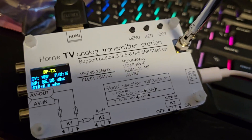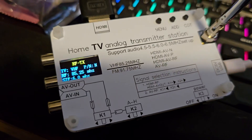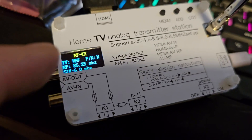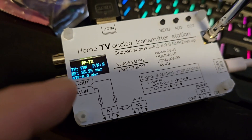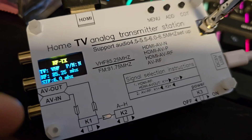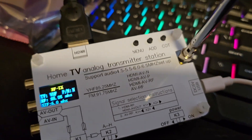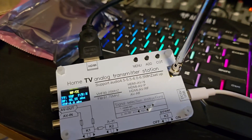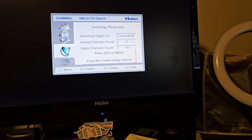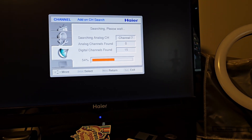We played around with this a little bit and I think I might have figured it out. I think this was set to PAL signal — the PN there is PAL/NTSC — so I switched that to NTSC. I also switched it from UHF to VHF at 85.25 megahertz. I did adjust the SIF rating down to 6 megahertz. I'm still not picking it up on the channel I've set on the CRT TV, and nothing here on our Hisense either. Let's go ahead and let it just scan through the analog channels.